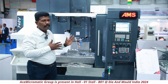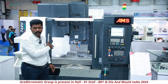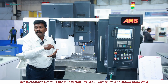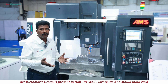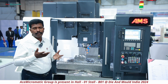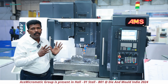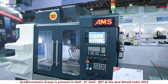This 740B machine has important features for mold making. If a power failure happens while finishing a mold cavity, the cavity can get a dig mark. To avoid those issues, we have an automatic retraction feature — when power fails, the spindle automatically retracts. After power is restored, the operator does not need to edit the program manually, as an auto-restart function is available, allowing easy resumption without any interruptions.